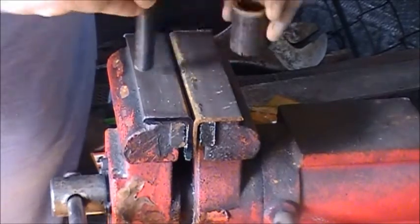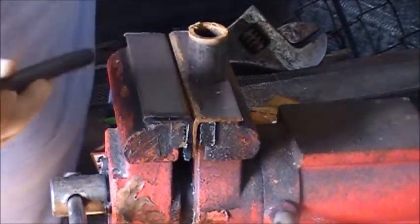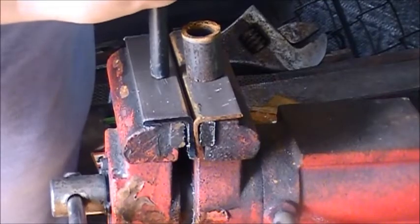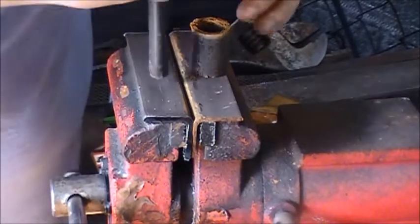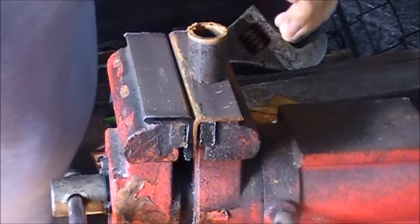And then you'll be able to swap out sizes and different things like that as you need, and interchange bits. That way you don't need to have one set jig like a lot of people do for these, and then have to make more and more and more. Just make like 2 sets of each size, so that if you need to make S hooks or whatever, you could. But yeah, interchangeable bits. I think it'll work nice.